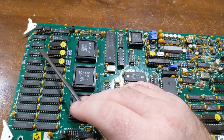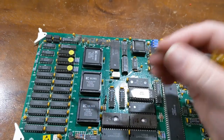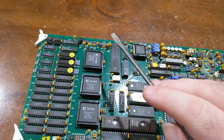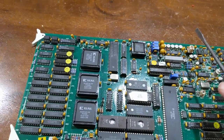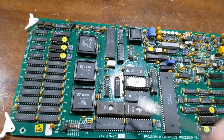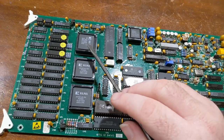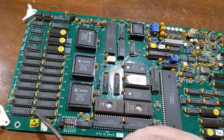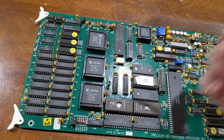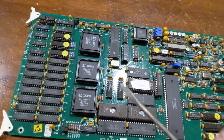Well, this counter obviously overflows at 65,536, back to the beginning again. So that'll give you roughly 682 lines and some odd pixels. So there's a section of memory, around 3/4 in to the end, that is unusable because this counter will overflow and repeat back to the beginning again. So inside this FPGA is a paging register, and that paging register selects which bank you're going to be looking at. So there are 4 banks of 682.579 whatever lines.